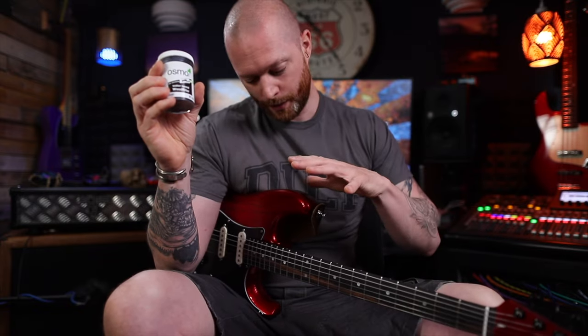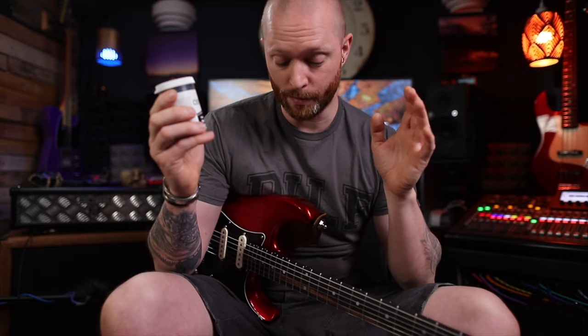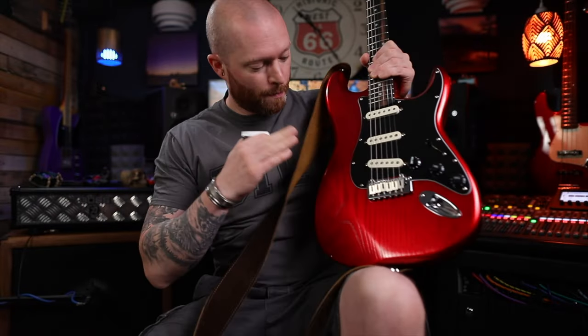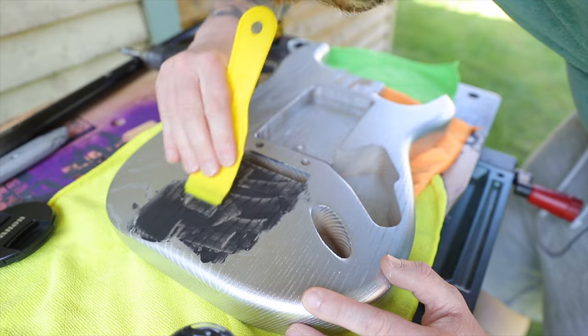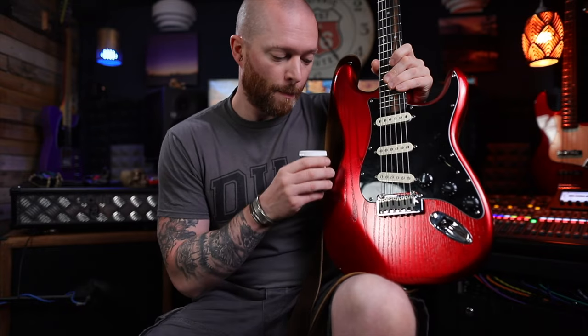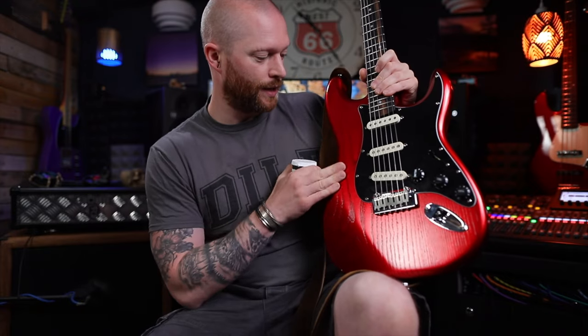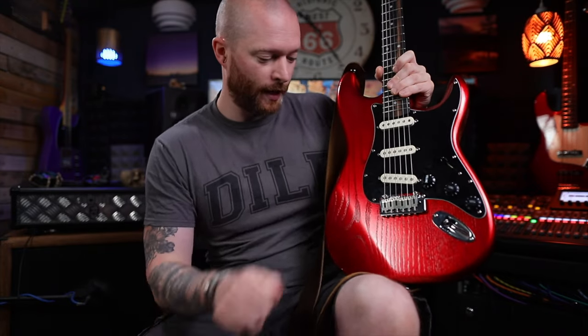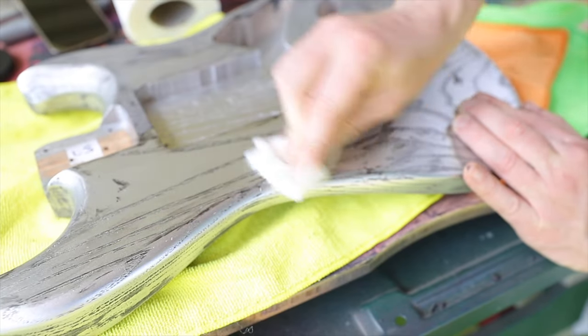The next day is your filler day. Everything's been sealed in. Use a plastic filling knife — I'll put a link in the description — and push the grain filler into the grain as best as possible. You can use your fingers too, just really push it in. Get rid of some of the excess but leave a bit, then leave it for a period of time to dry so it sets within the grain. Then use the filling knife to remove as much excess as possible, but don't scratch the finish — just go easy.